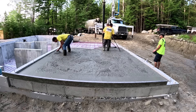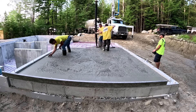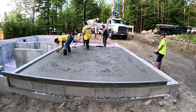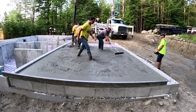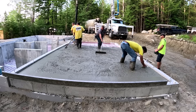And in addition to that, you're going to get to see how we pour concrete like this — why we use the floor mix we use, why we have it at this slump. Slump is how dry, stiff, or wet the concrete is. We tend to pour a kind of looser concrete because we use water reducer in there.